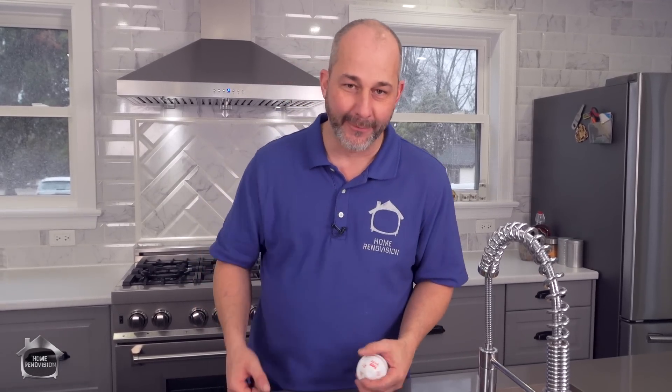Today I'm going to show you one of my favorite hacks. When you're doing islands and putting plumbing in an island, you really run into areas where you might have difficulty with proper venting. Venting is really described like this: water goes down a drain, and when that water travels it creates a vacuum behind it. You have to have fresh air following the water — that's venting. If you don't have fresh air, you're going to run into problems. You get that gurgling effect where you fill your sink, pull the drain, and the water goes really slow. When water travels really slow, any debris or solids get trapped in the pipe, and then you run into blockage and all kinds of other issues.